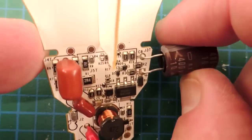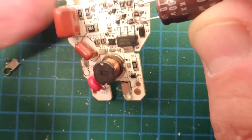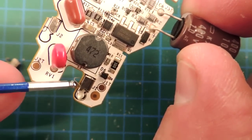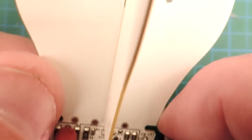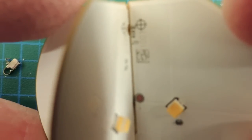What really strikes you about this assembly — and this has been true of many Cree products — is the real attention to manufacturing and engineering. There's clearly not a lot of human intervention required here. Even by pick-and-placing these special spring-like clips, they can eliminate any hand soldering, which is important because hand soldering tends to be what fails the quickest. It looks like there's essentially no hand soldering on the bulb — it's just simply an assembly.